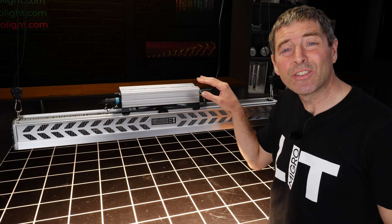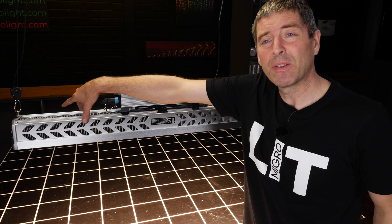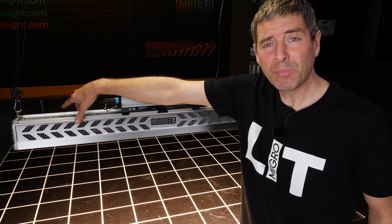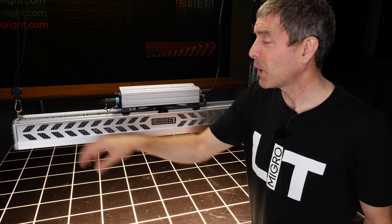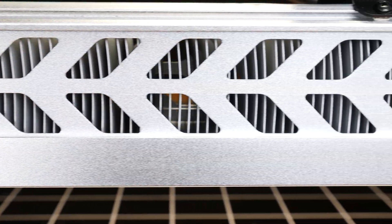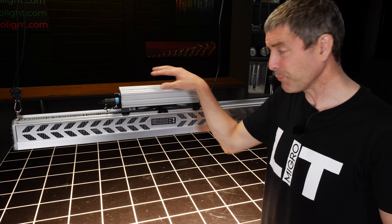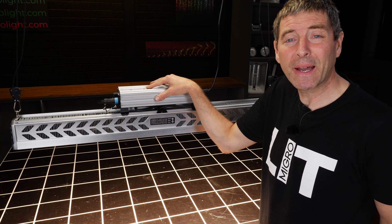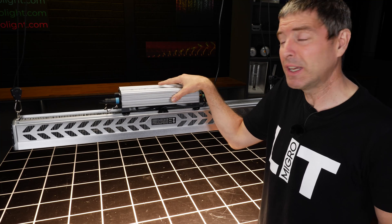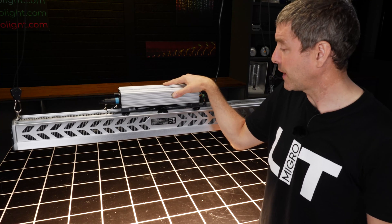The structure of the light is a long format — about three inches, around 80mm width on the large heatsink with multiple fins on the back, and the LED board mounted on the front with a glass cover. The driver is mounted on the back, although it does have additional cable so you can mount it remotely from the light fixture itself, with a couple of meters of cable.